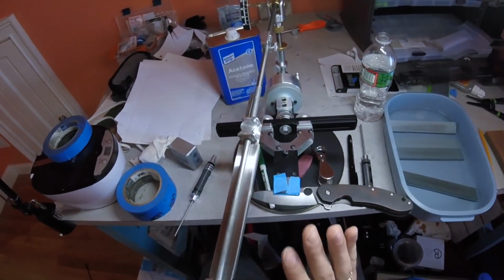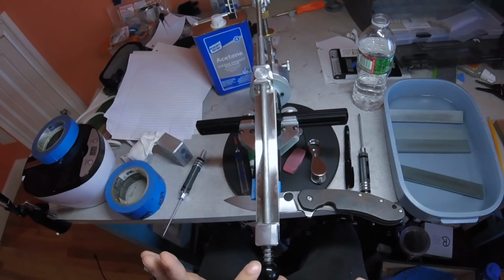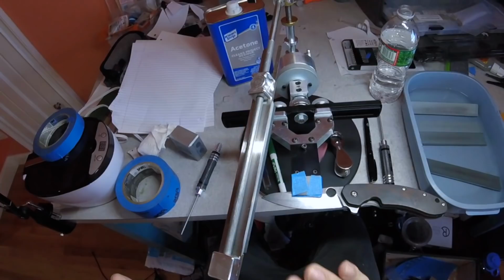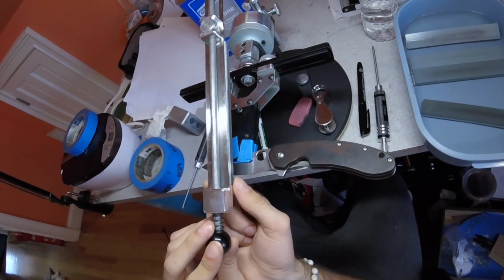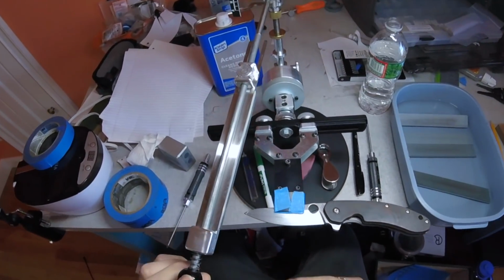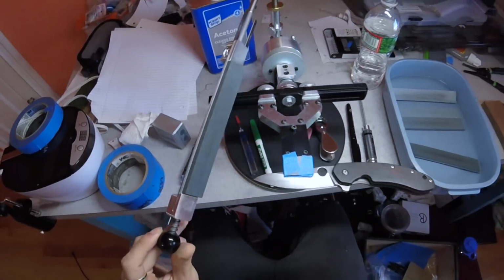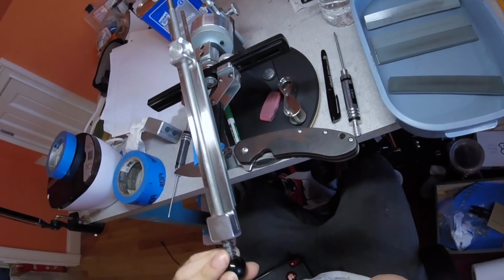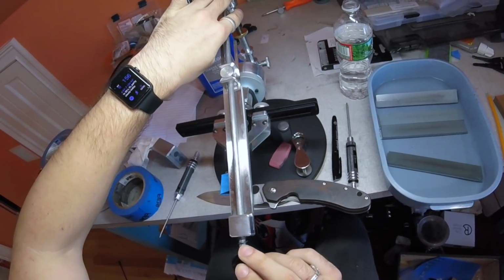But now this is going to avoid 99% of those slips that people ask about, and they talk about stray diamonds, okay? It's not. It's your stone slipping onto your blade. It's going to look about this wide. It's going to have a straight scratch pattern, and people are going to tell you, oh, just tape your blade because it's the diamonds, it'll break in, blah, blah, blah. It's not going to break in to stop that. You need to never slip up your blade. If you have blades you really care about, just get the stop collars.